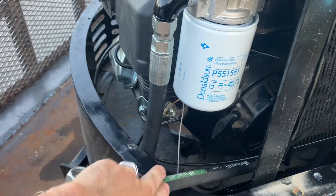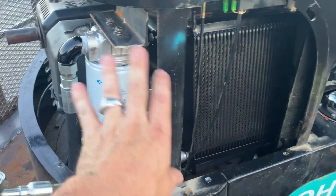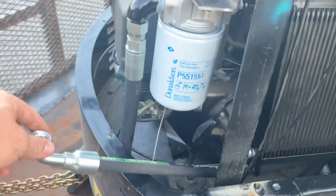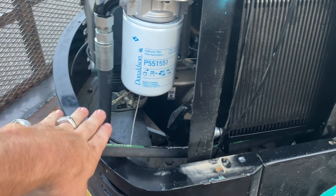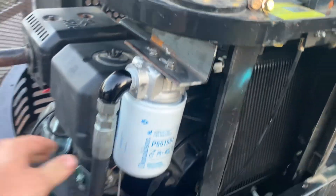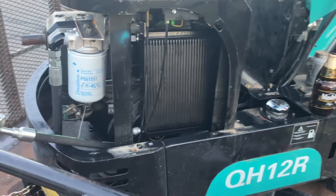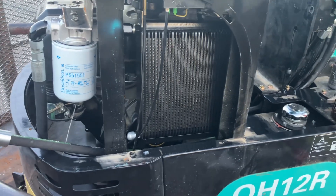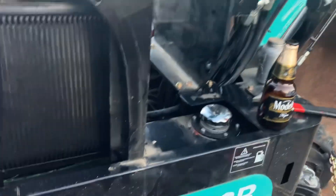What I did was have the shop give me a couple of feet of hose without crimping the end. I knew the length I wanted on one side but was unsure on the other until I got everything mounted. That allowed me to install the hose, figure out where I want to be with the 90, mark the hose, and take it back in so the guy can crimp it for me. I'll be able to package this a lot better than just giving a random measurement. I put very good quality oil — full synthetic Castrol Extended Protection 20,000-mile oil — and I bought expensive full synthetic hydraulic oil. I'm just trying to make this thing last and do what I need it to do.